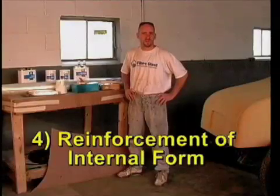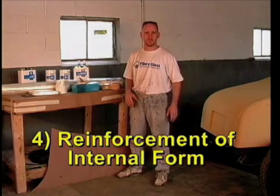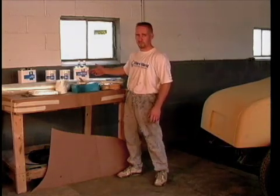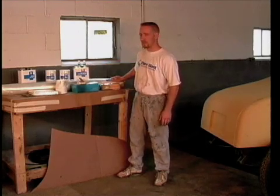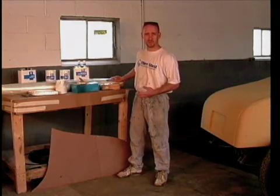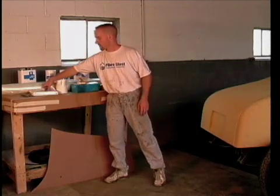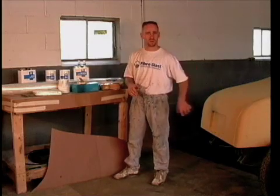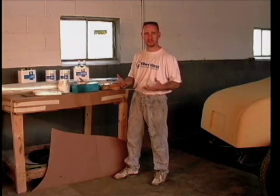The shape has been totally developed in the foam at this stage, and while it remains fragile, the next step is to reinforce it with fiberglass fabric. I'm going to use a regular general purpose polyester resin with an appropriate MEKP hardener. The fabric I'm going to use is a 10 ounce fiberglass fabric — the schedule will be two layers of 10 ounce fabric followed by one layer of 6 ounce fabric. The 6 ounce is used because the finer weave will be easier to fill with primers and body fillers so you don't see the weave printing through paint later on.